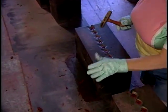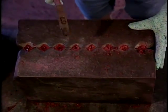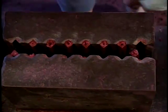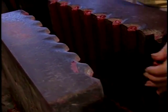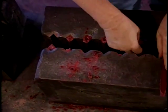To crack the molds, I got a bead on them to bust them loose inside so that it'll open the mold. These molds weigh 80 pounds each half. Once I get them cracked open, I clean them. On the ends there's little extra pieces, and they will not fit in my boxes if I leave those on, so I clean them and stack them.